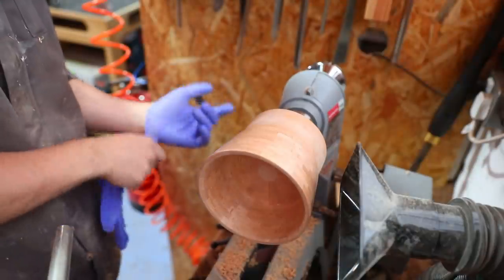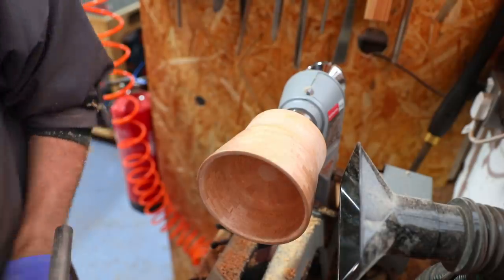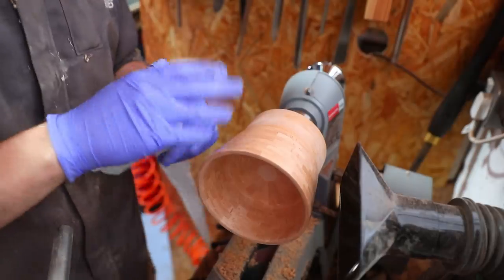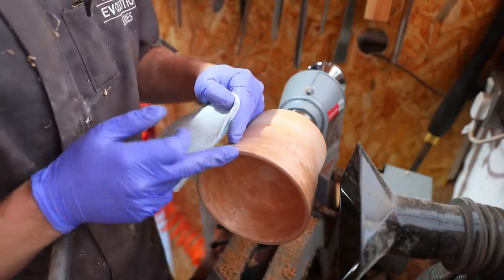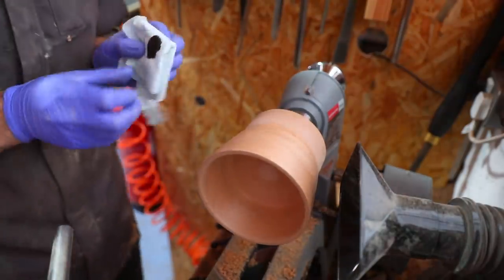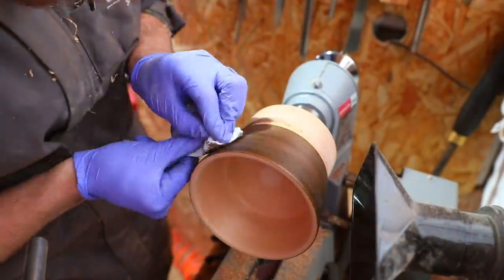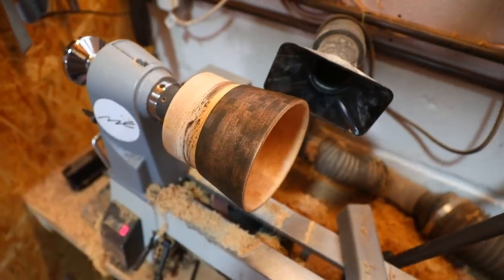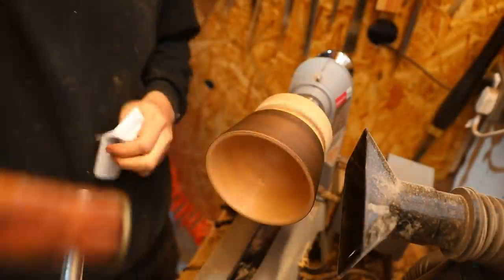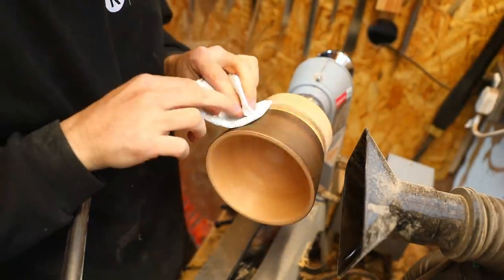I'm going to finish the outside now while it's on the lathe. I am opting for dark oak wood dye because beech takes a stain very well — it would just be rude not to. I think I'm only going to do the outside on this bowl; I quite like the idea of leaving the inside lighter. Knowing my clumsiness, I'll probably accidentally hit the top edge, but I have full intentions of just doing the outside. After a couple of hours, I'll finish with tung oil — nice and simple, quick drying.